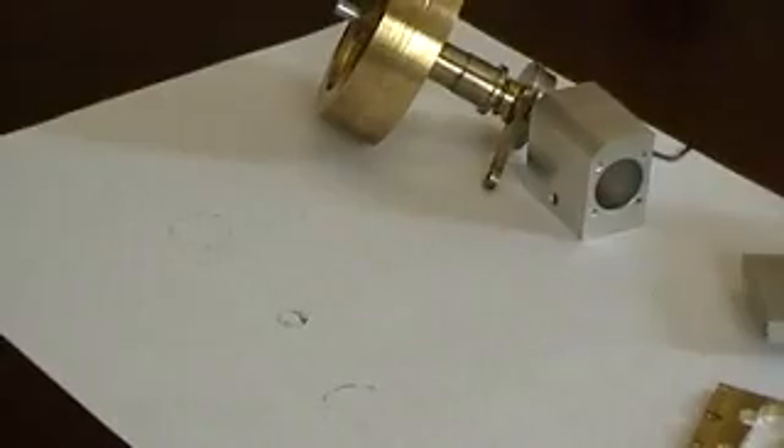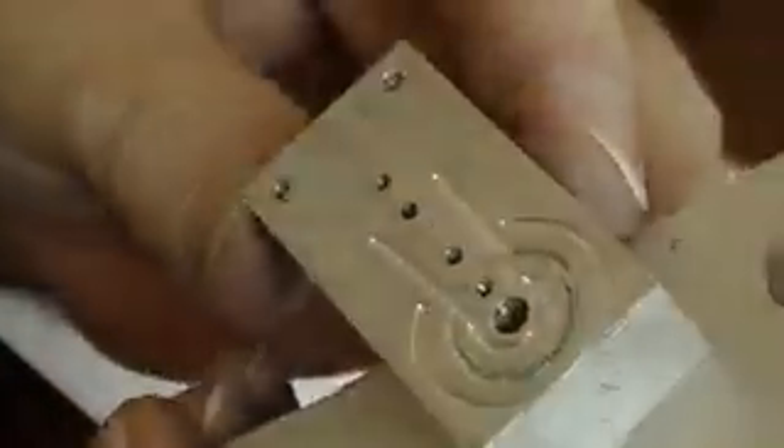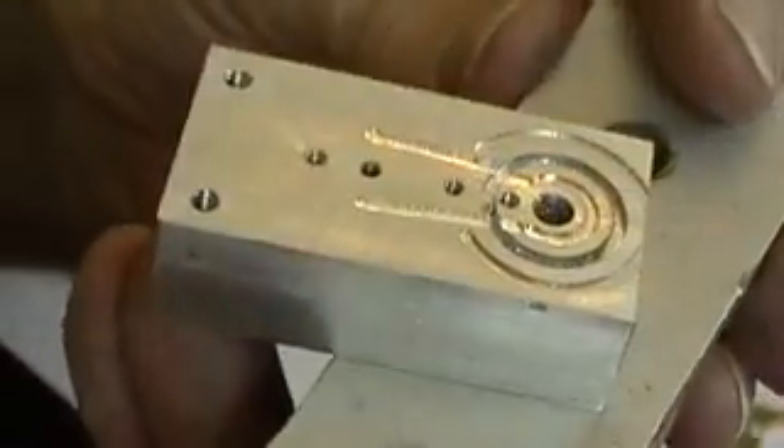That's about as far as I've got for the moment, and as things progress I'll give you a better update. Have another look at this little jig I made to hold and machine the eccentric arm — it works very well. It's nice and thick so I can take a bit off the top and remachine it to do another job. I've used it several times for machining small parts. It isn't the part itself that you have to machine very often, but it's the mounting plate or fixture that will enable you to finish the part itself. Usually for every part you make you've got to make something else as well — but then that's part of the fun.